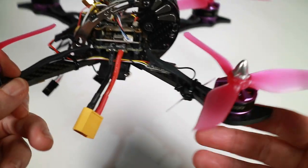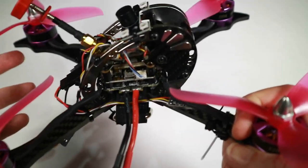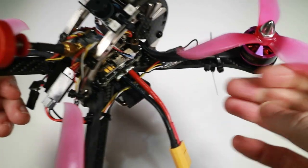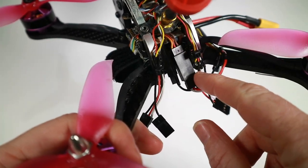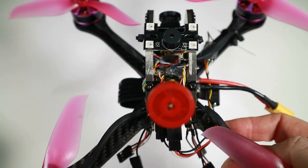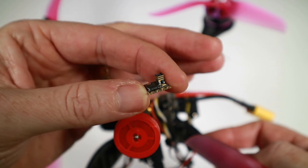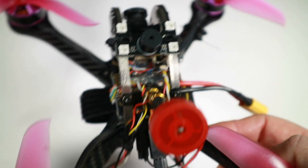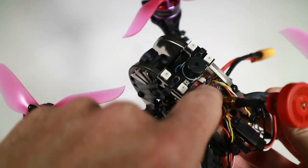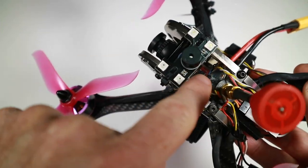This is your sort of very generic regular T antenna which we expect to give the best signal. With T antennas you really have to put those out somewhere — you can have them up vertically, we're putting ours on the leg which is pretty normal. We expect to get a pretty good signal from this one. There's no GPS here so I won't be going great distances relying on any rescue, hence I've put that beeper on board just to make sure I can find it if it goes down. What I intend to do is fly that as a test and then unplug it and plug one of the other two in. This one is connected to the little ceramic tower antennas.